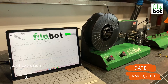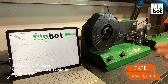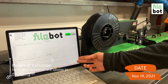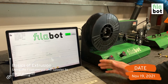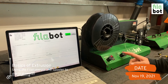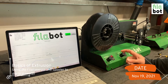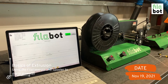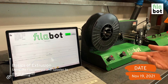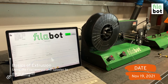After we've placed our filament on the spooler, it's time to dial in the desired diameter. Thanks to the filament gauge, we're able to have a digital readout recording of the diameter. Right now our desired diameter is 1.75 but we're up closer to 1.95. To bring that diameter down, we're going to use the drive knob on the spooler — turning it clockwise will speed the wheel up, which will in turn create thinner filament. It'll take a moment for the filament to actually get thinner as it travels down the line, but you'll see the diameter quickly begin to drop. You want to dial it in so you're right around 1.75.